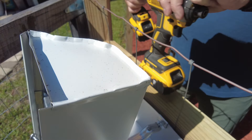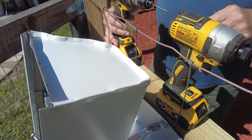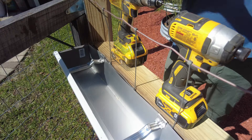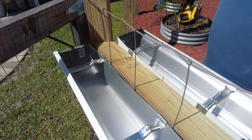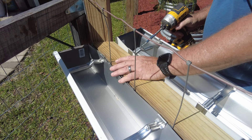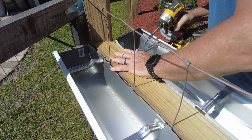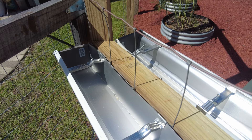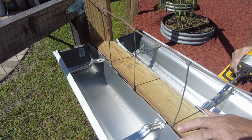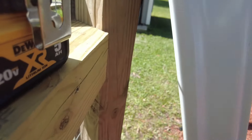Here's probably a better view of the crimped end of the gutter, but we're going to go ahead and start putting this up. I still need to drill the pilot holes for my screws, but another way you could locate those pilot holes would be to put the piece in place and start each one of the screws just a little bit, then back them off and you'll have a mark where the screw pierced the wood.